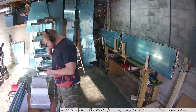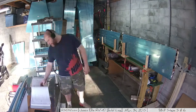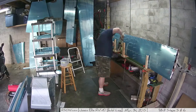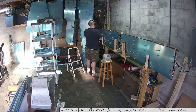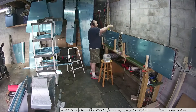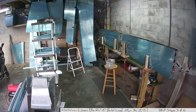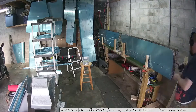This video actually spans three days: March 31st, April 1st, and April 2nd. I'm reading the instructions to fully understand what I'm supposed to be doing here, which is marking some screw holes — certain holes on the top of the skin — and that's important. This is where you first define which side is top or bottom. By marking those holes, I'm saying this side is top, and don't drill or dimple those holes.